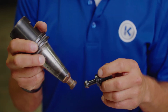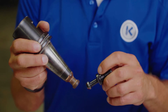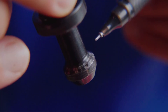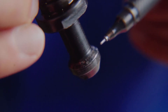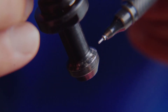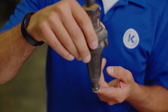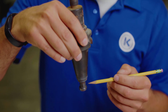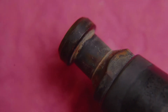In these two examples you can see permanent wear or even deformation marks underneath the head, suggesting that these pull studs are worn out and need to be completely replaced with brand new pull studs. Using these continuously will cause wear to your gripper fingers and other parts of your drawbar system inside the spindle. This is an example of a pull stud cleaned up — as you can see, the underside head after all the particulate is removed appears to be in good finish, no major chips, dings, or dents, and the fingers can still make a good contact point on the pull stud.